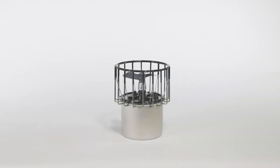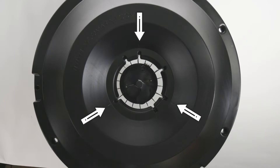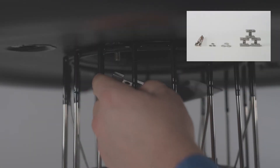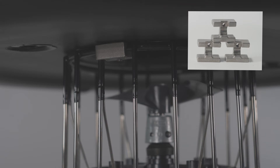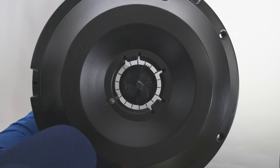Place your Casco's surface aerator on a table or other flat clean workspace. Place the float on top of the surface aerator's cage. Note the three marked slots — these are the points where you will attach the float to the surface aerator. Then grab your quarter-20 by three and a half inch screws with matching split washers and flat washers. Place one flat washer and one split washer on the screw. Hold the retaining clip on the top of the cage, making sure the side with the pre-threaded hole is towards the center. Then secure the bolt and the retaining clip and repeat for the two remaining float spots.